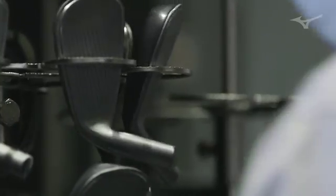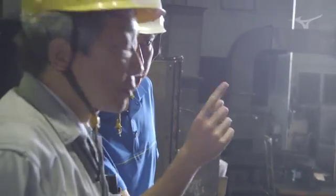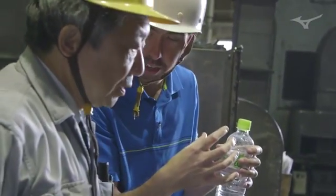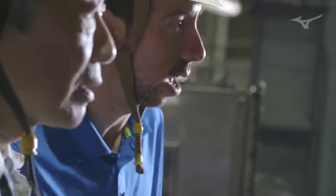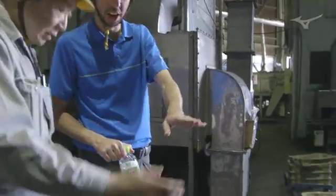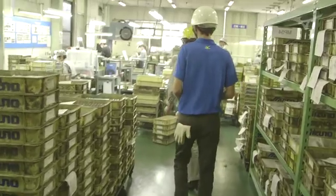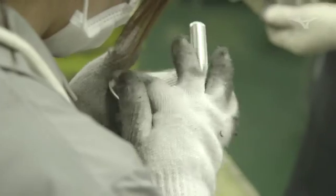So after the second hydraulic press, it goes into a sand blast that removes any of the impurities that have started to oxidize on the golf club. How long does the blast process take? Is it short? 15 minutes. 15 minutes for a set of heads? Okay. So already have score line here. Yeah. So this is final. Final done. Okay. So this is the final stage of a club being made at the Chuo factory. What happens in this room is clubs are getting the final logos placed on as well as the inspection samples before they go out to go into your bag.